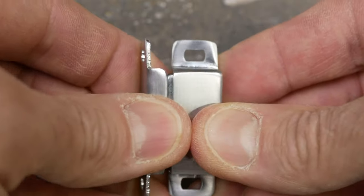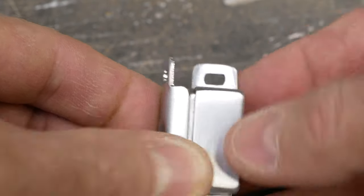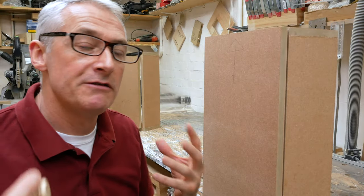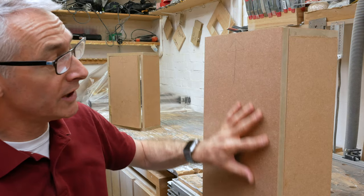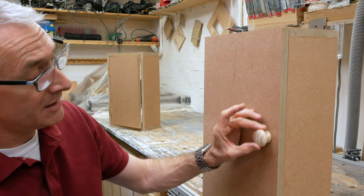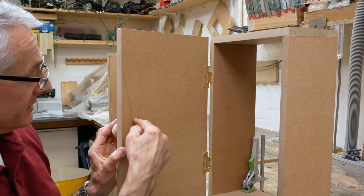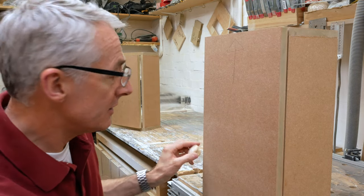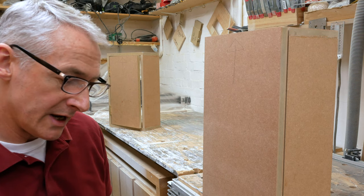These are 45mm catches with six kilos of pull force needed to open them, so they're perfect for small cabinet doors like this. When fitting a catch, one of the first things you've got to consider is where you want it to go. On a door like this you're probably going to have a cabinet knob, and if you put that around the centre you absolutely don't want to end up having to fit the striker plate around it. So I always try and fit my cabinet knobs just over halfway up.